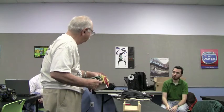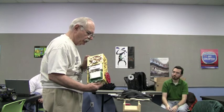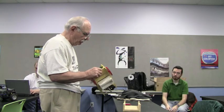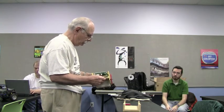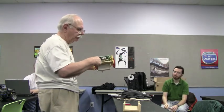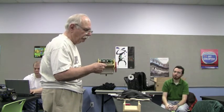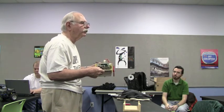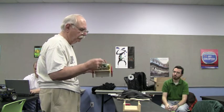I bought one of the H-bridges that I hope will run this little motor — it draws about at most a half amp. Right now I'm doing the layout on a power board that I'm going to put under here. It's going to have a switch for turning the power on and off, and I think I'll have two regulators on it for five-volt power to go to different things.